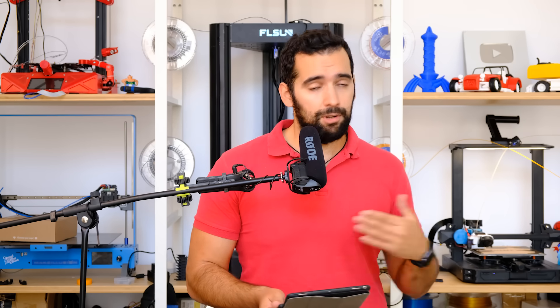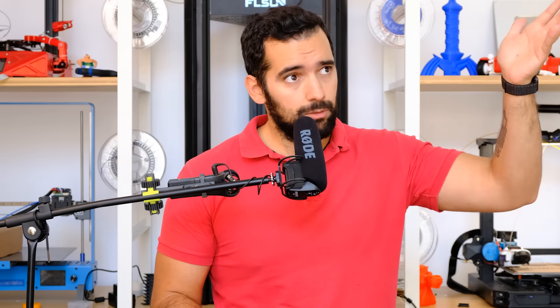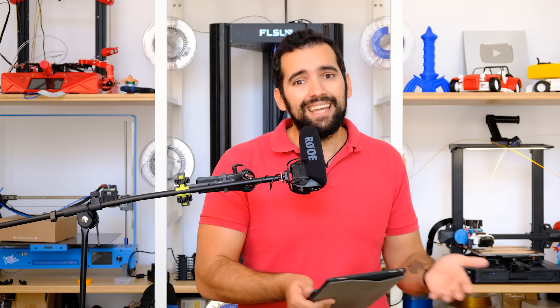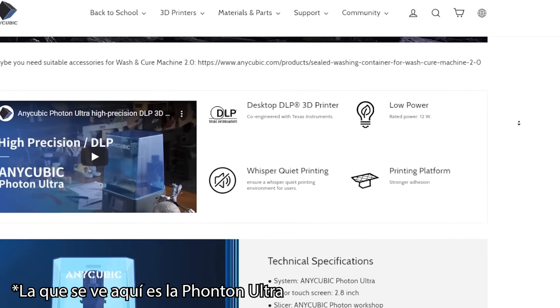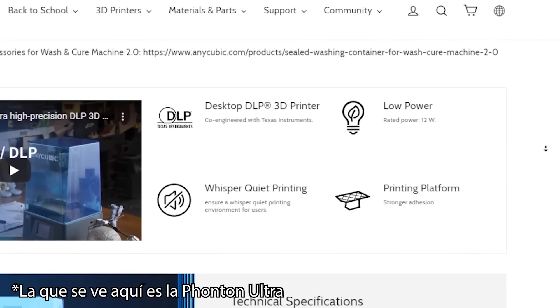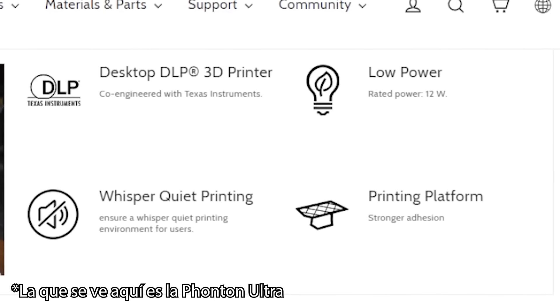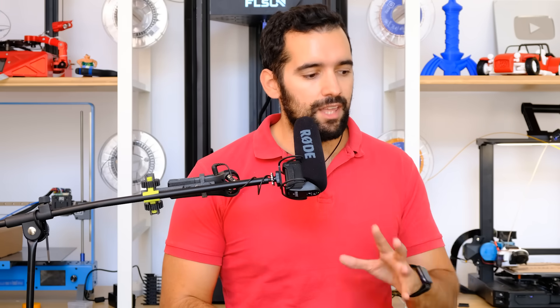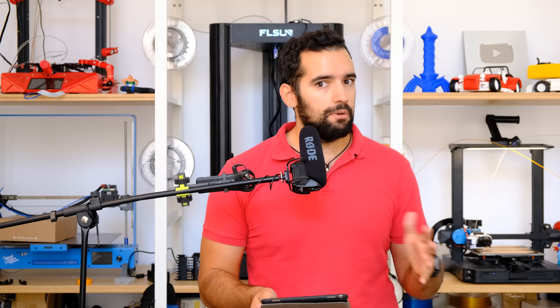Guys, I with a resin printer doubt that I have reached that many hours of printing in my lifetime. It has never been my LCD that failed me — if it has failed it has been for other reasons. But it is not bad that they claim this useful life. And then the consumption, which I think is what is most interesting to me: this machine consumes 15 watts, meaning some light bulbs consume more electricity than this resin printer, which seems very cool. Anycubic says that an equivalent LCD printer consumes 60 watts — which is already little for a 3D printer — but they are four times less, which is nothing bad.